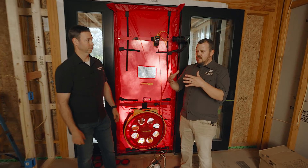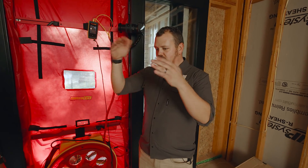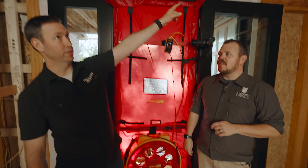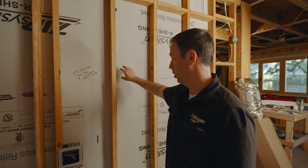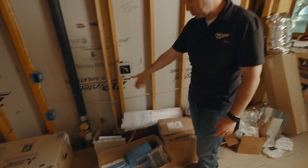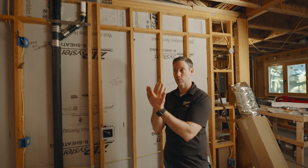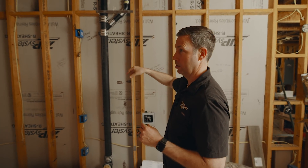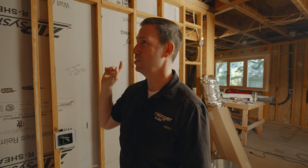Zip sheathing runs all through there, then they just put garage doors and another wall on. In my case I've got a continuous space — the wall between my house and my garage. I used zip sheathing in the wall and taped it, and I'm taped to the floor on the inside, but on the outside this band joist area is pretty leaky, even though I've wood-blocked it. It's got a fair amount of airflow. I'm curious whether there's much difference between spray foaming that versus putting zip sheathing and taping it. I actually have a couple of froth packs — I wonder if tonight or tomorrow I do a little froth packing and see if we can get that lower.